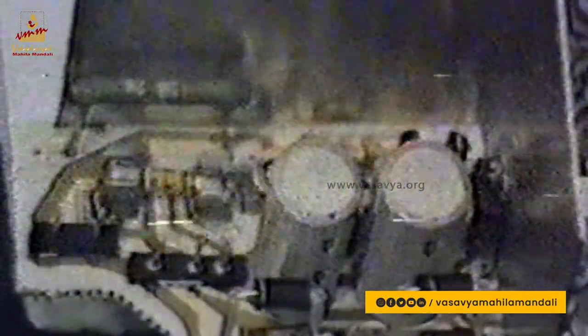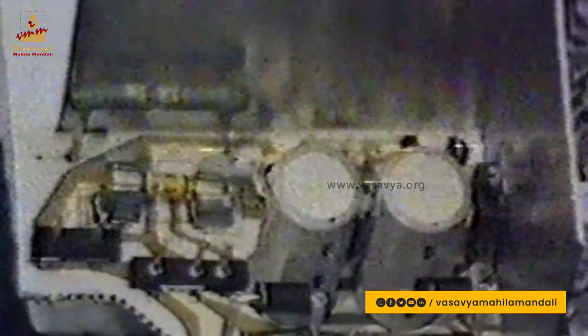Battery operation is also stable and trouble-free. The internal supply is regulated because an automobile battery can change its terminal voltage from 13.6 volts in a fully charged state to about 10.8 volts in the lowest discharge state. In spite of such a wide variation, the TV set will perform and give stable performance unaffected. In case of unlikely failure in the mains transformer, the AC line fuse will ensure that the transformer or any other part does not get damaged. An additional separate DC-side fuse comes into picture for both mains and battery operation, providing further protection so that in the case of any malfunctioning, damage will be minimum.